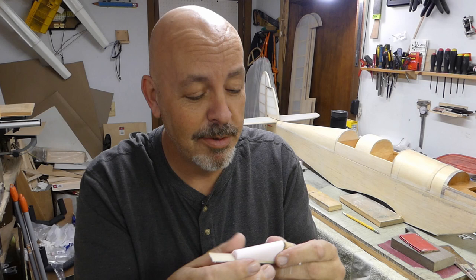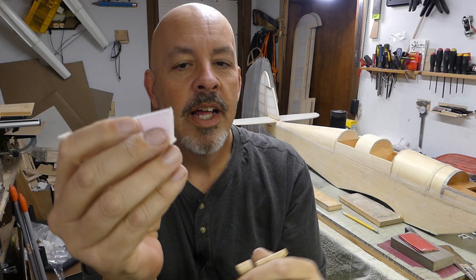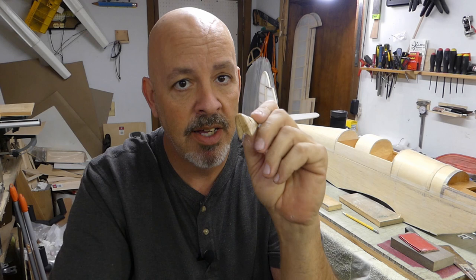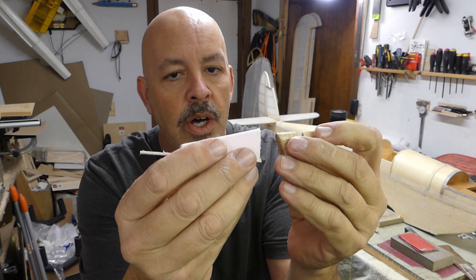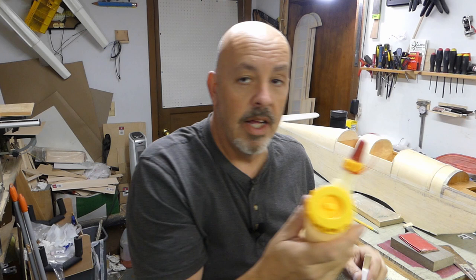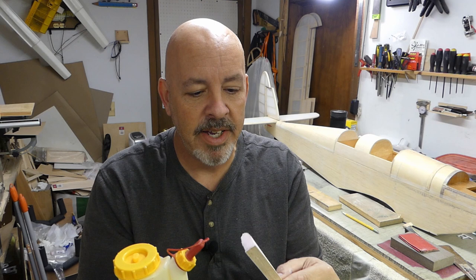It took three minutes and two seconds — I know that for sure because that's what's on the camera. We've got the height pretty good. The side profile is set up very nicely. This part is thinner than the outside because we're putting two or three layers of three-quarter ounce fiberglass over the top, so it will fit exactly where the original piece sat. The height is approximately the same size as the broken tail.